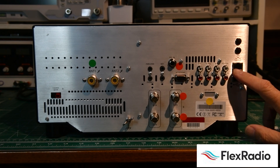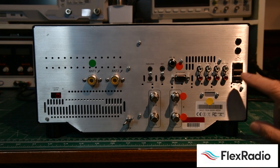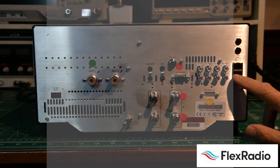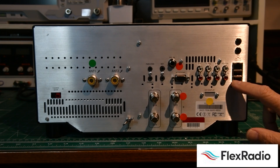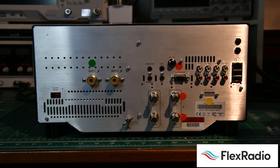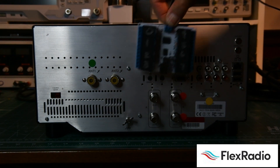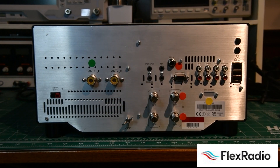We have a LAN connector, because that's how the radio communicates with clients — how we control the radio and see things. These two USB ports are for CAT data to send data to external devices using inexpensive RS-232 devices; you can buy them on Amazon. They need to include the FTDI chipset. They also have what's called bit or parallel cables — so that every time you go to a band, a particular level goes high, which is helpful for controlling external devices. You can buy eight-channel USB relays online and hook up a transmit indicator light, which is pretty handy.